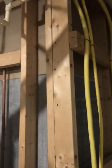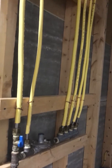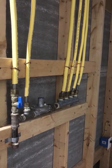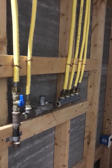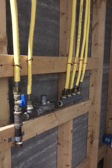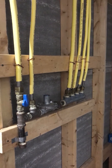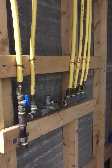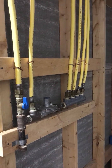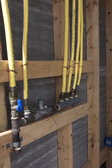When you come around the corner you can also see where all the CSST piping comes into your home. So the question is: do you have this in your home, and secondly, is it bonded? As you can see, there are no copper wires attached to any of these valves, which are required by national electrical code. When I come back through, we're going to show you what it should look like.